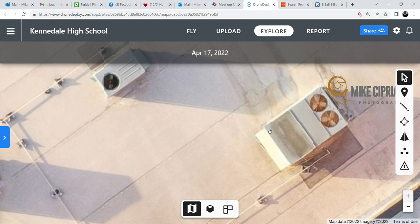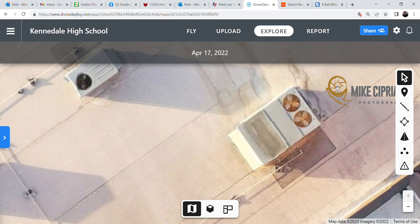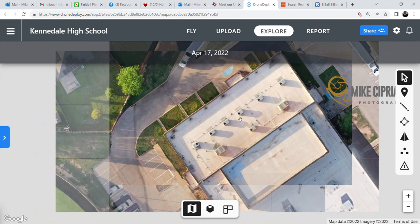You can see these drains here are definitely very clogged. Also, looking at this particular compressor, we do have some sort of leakage issue — again, that could be something as simple as a clogged drain pipe, but it's an indication to have your maintenance crews go out and fix it.